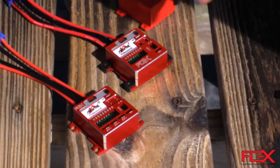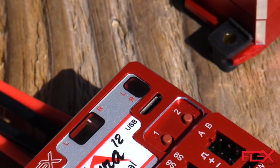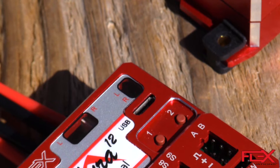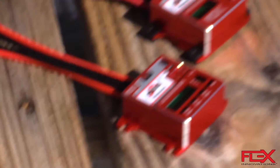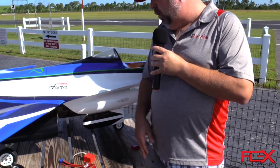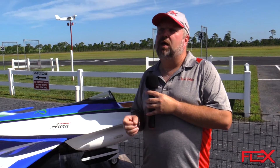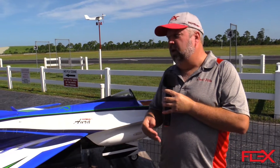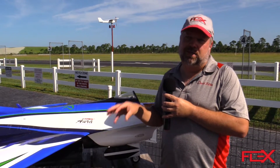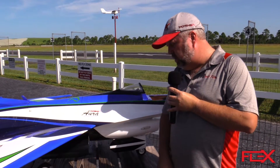With the power system you also have a window with LED lights. There's a pair of white lights — if your batteries are plugged in, power is on, and batteries are near equal voltage, you'll see two white lights indicating batteries present. There are also two red LEDs that give a quick view of battery status. They're programmable via the Aura Config tool — for example, if voltage drops below 7.6V you get a flashing red LED, and below 7.2V the LED goes solid red as a stronger warning, so you can glance at it on power-up and when you land.